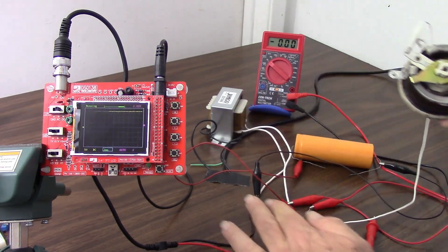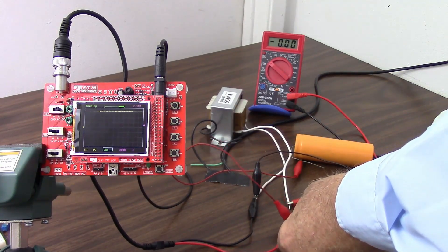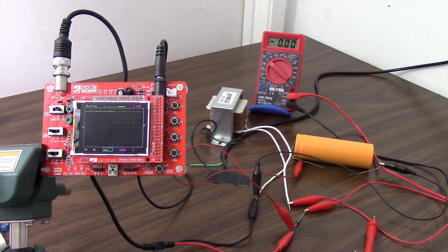So that's what happens when we load that down. This will work fine if we have a pretty small load and we're not too sensitive to the regulation. If this is a sound circuit or a video circuit, you have to have better regulation, but we have a finished power supply if all you need is an unregulated output.